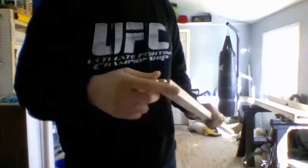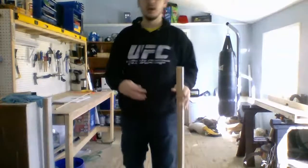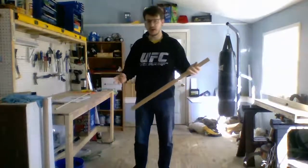And then the one thing that you will do for the end pieces, and you'll see me do this later today, is that you will turn it up on its face and cut a 1/4 inch rabbet along the edge so that you can put an end piece into that exact same slot. So that is the concept I'm working off of today.